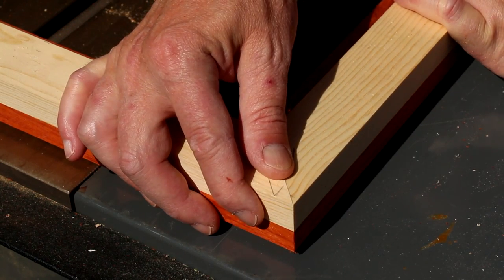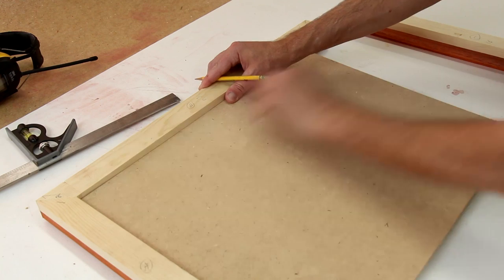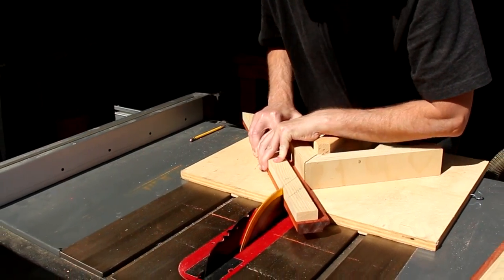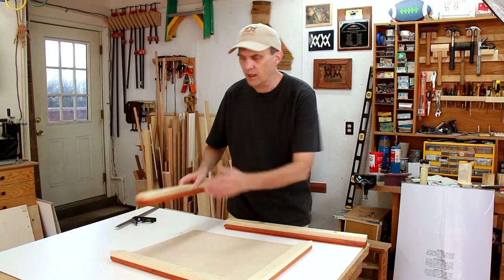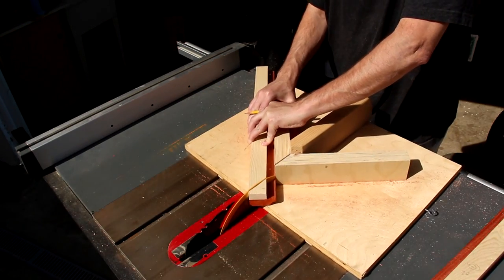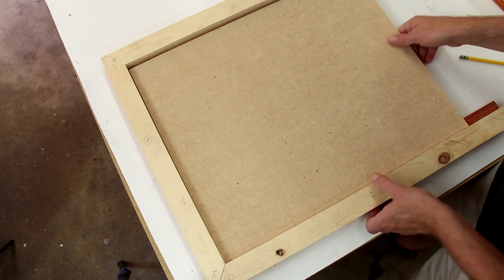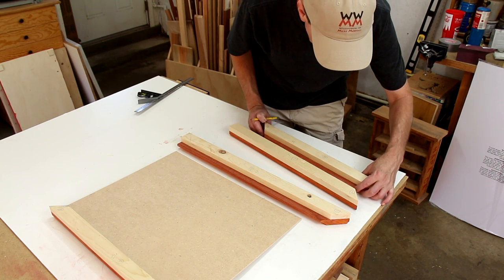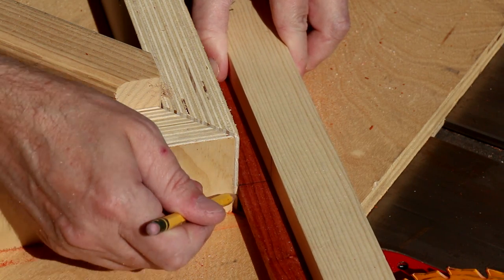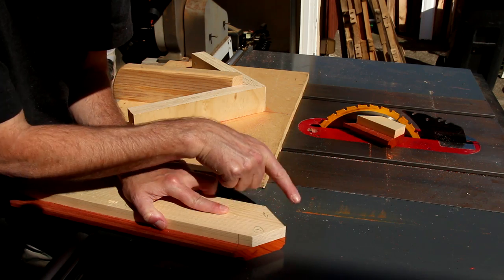That way they meet up perfectly. With this first miter cut I'll put these together and place my 16 by 20 art in. With that together I can make a mark where I want to cut my next miter. With those two pieces now I can cut miters on the other two pieces — I'll cut the ones I don't have to measure first. Now I can put these three pieces together and test it out. I'll mark the opposite side and try to get it the same size. To cut it, I just take that mark I made and line it right up with the edge of the slot. I can see I've got a little bit more to take off of this one.